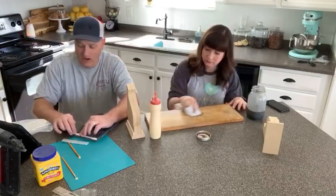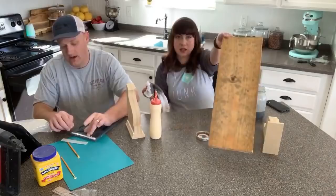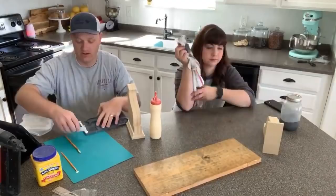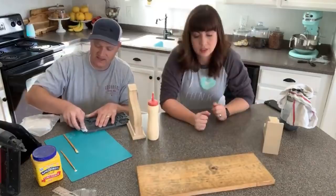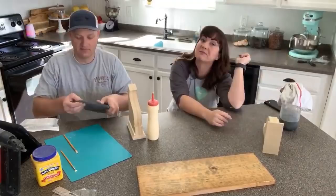It looks like mostly everybody is saying hi. The real stain is all-natural milk stain and it activates with the raw wood — so it has to be on raw wood to use it. It won't sit on top like some oil-based stains or gel stain will, but it has really cool properties. It doesn't stain your hands all gross; you can use it indoors without any ventilation. It's great stuff. This is after real stain, before real stain. I probably should have sanded it but whatever. We also sell that on our website at jamierayvintage.com. This is number two, which is like my most-used one, and they only sell them by the quart, so I usually only have one quart open at a time and keep it in my fridge for about six weeks.